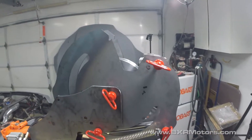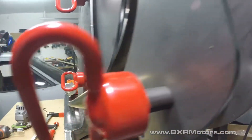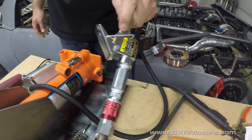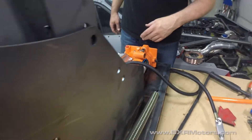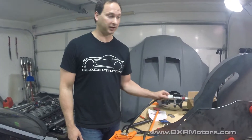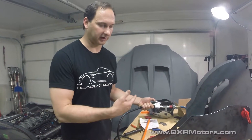We did a full 90-degree bend, or close to it from what it looks like. The air trigger has a lock on it, so you've got to be careful — it kind of allows you to leave it unattended. That's just part of the Harbor Freight deal. Because I let off of it thinking I was at the 90-degree mark, it just kept going. My air pressure is off, so it's not so loud, and it slows down because I'm running out of air pressure — otherwise it would kick on and the speed would stay up.